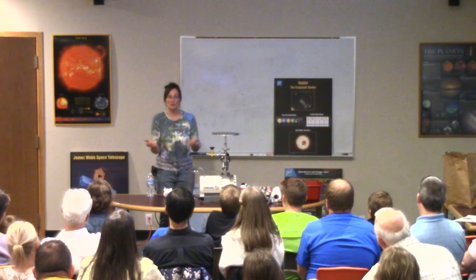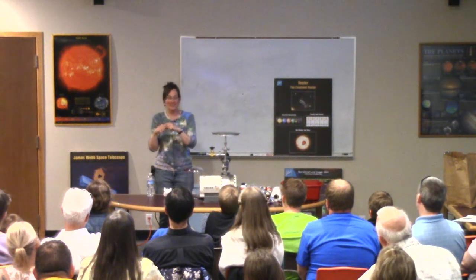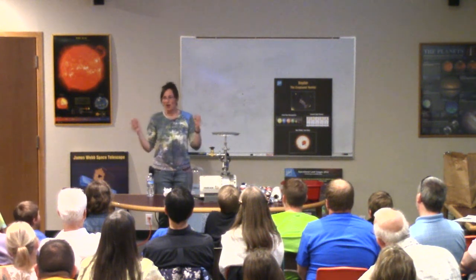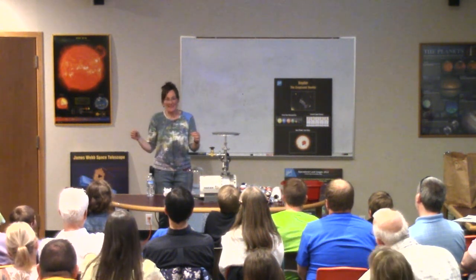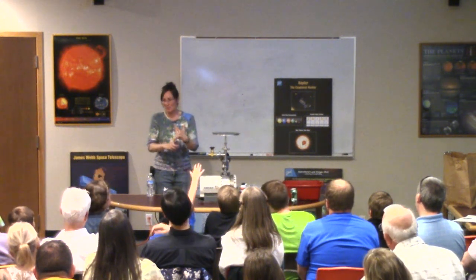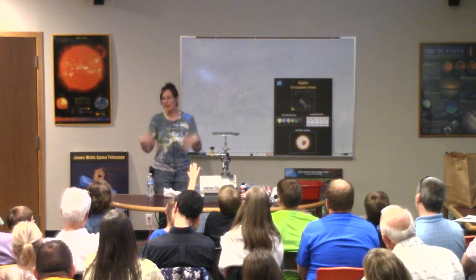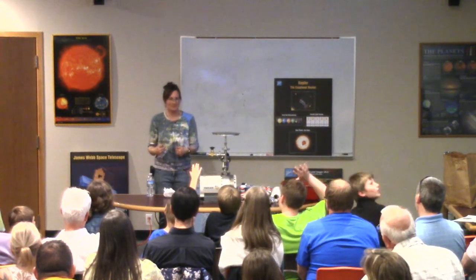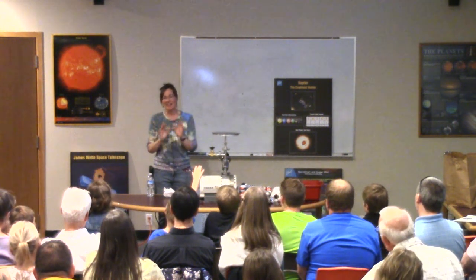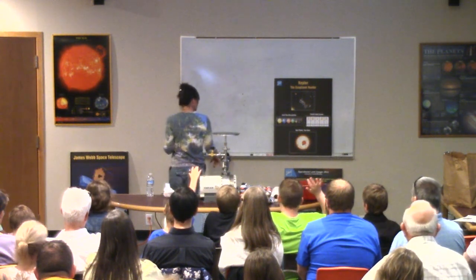And so what we do is we make the electronics or we make the cables. The cables are sort of like the circulatory nervous system of the satellite. All of them, before they're put on the satellite, are put into a vacuum chamber and put at a high temperature, cold temperature, and under a vacuum, cycled, to make sure that all of the volatiles are off of it. And it has to be super duper clean, because what you really want is not to have anything on the satellite, especially the optics.